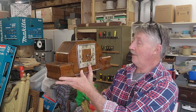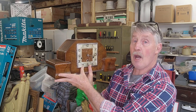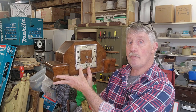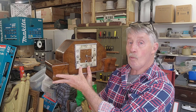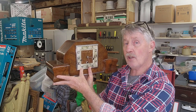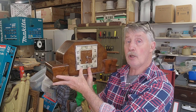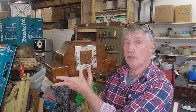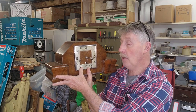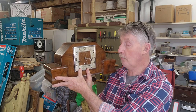The complaint with this clock is that the door hinge is broken — well, partially broken — so we have to solder that up. The chimes apparently don't wind past a few clicks, which makes me think they're fully wound and not unwinding to drive the chimes. He says they only work a couple of times and then it doesn't chime for the rest of the week. The actual clock mechanism and timekeeping appears to wind and work well and keeps reasonable time, so it's something to do with the chimes.